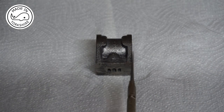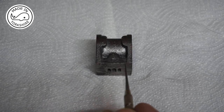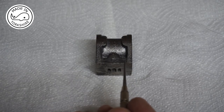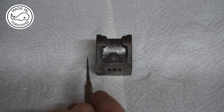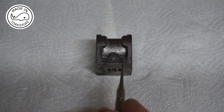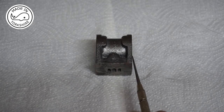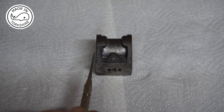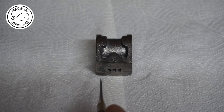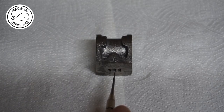The width of the casting is round about 1.225 of an inch and it needs to be machined down to 1.125, so one and an eighth of an inch. That means we need to take 50 thou off this side and 50 thou off that side. So the approach I'm going to take is to put it in the four-jaw chuck and take 50 thou off one side, then bore out the centre, then switch it round and take 50 thou off the other side. Then I'll machine the port face and finally drill out the steam passages and the exhaust.